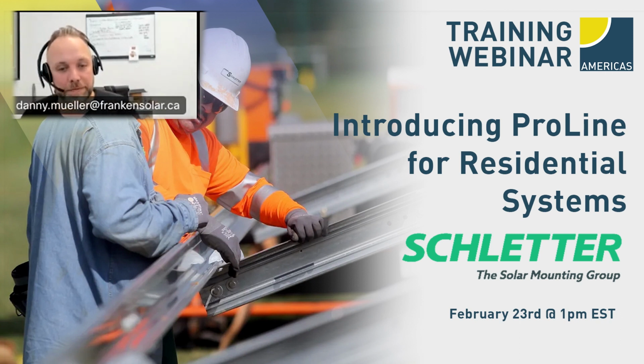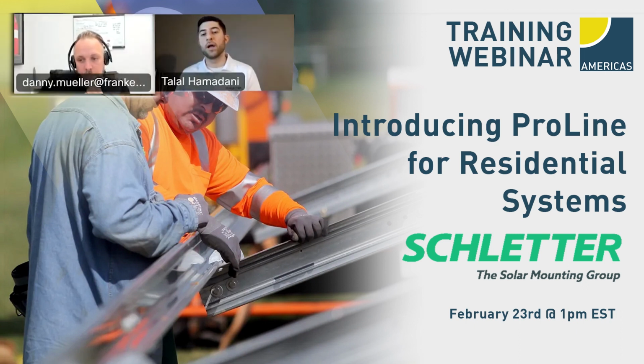And then there's a question from Steve Talal, and you can probably answer this one better than I do. He's asking how thermal expansion joints work with these new splices. For thermal expansion, I would have to get back to Joe on that one, but there is a gap that will be placed, of course, between the panels. With these splices, that's not an issue. You don't need to worry about thermal expansion until you're at about 15 or 16 meters. At that point, you need to have a thermal gap, just like you would with any other product, and you just basically treat them as separate arrays.